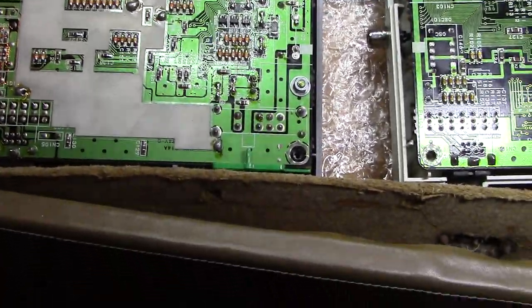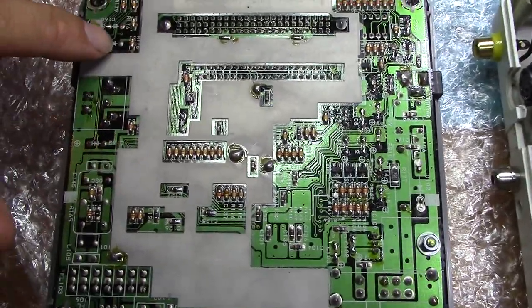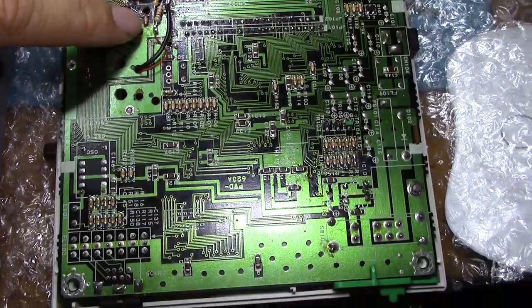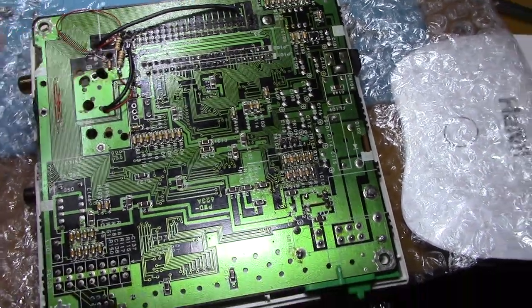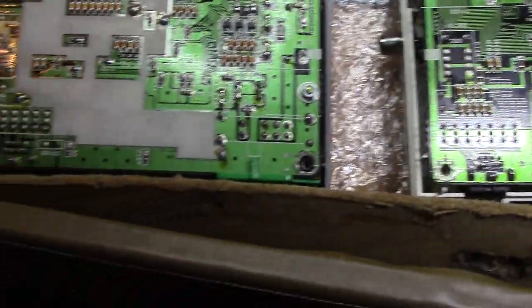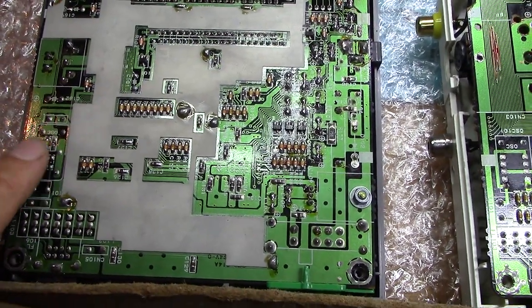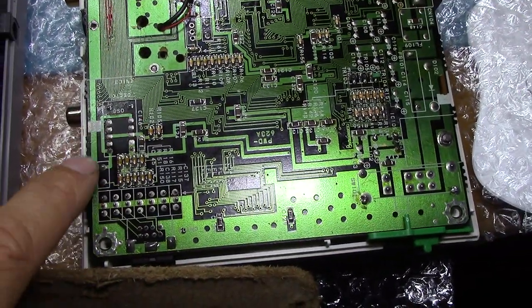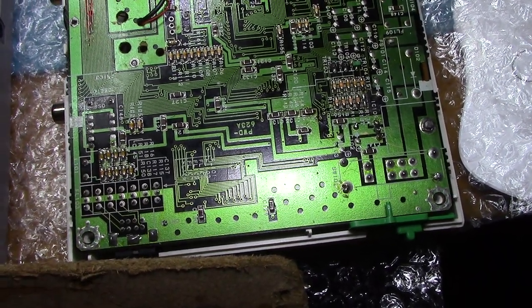Aside from that there's not too many differences. You'll see a little bit of difference in the layout — this is a 47 microfarad capacitor, it's part of the mixing video circuit here. The other difference you'll see is in the crystal oscillator, where it looks like they added a little bit of extra filtering for the TTL can oscillator right here, though there might actually be pads for it that are just underutilized in this version.